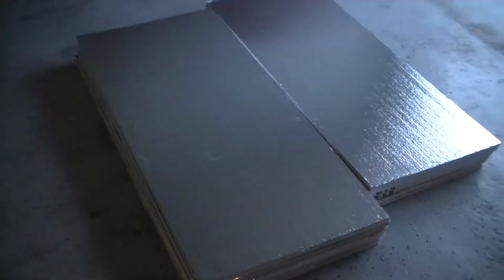I'll show you what exactly I mean, but the thing is, now everything is done. Now I have to do the same thing for the lower panels and on this garage door also. So I have all these panels ready. It's just a matter of pasting them on the garage door panels using the liquid nail. Let me finish this part, and once it is done, I will show you the last step, that is pasting this aluminium insulation tape on the panel.